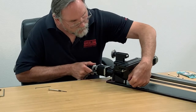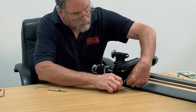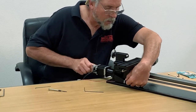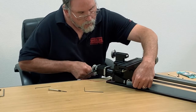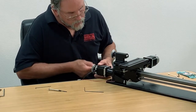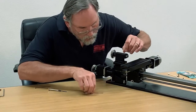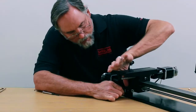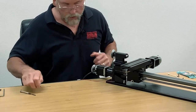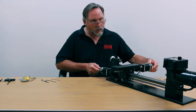I'm clearing my tailstock — so that's right on the edge. Let's try it again. All right, that's good. You can bend this slightly one way or the other. What I do is put my Allen wrench down here and bent the arm out just a hair to get the ball on the arm a little bit further forward. So you can do some minor adjustments with both the limit switch and the brackets. There you have it — that's the Z-axis and the X-axis and they're both set.